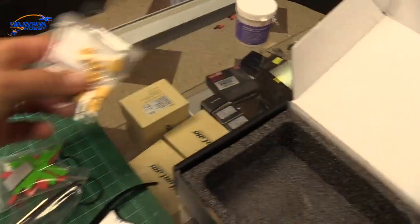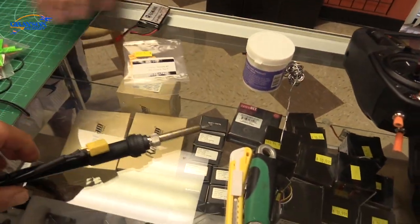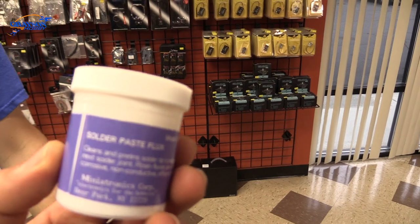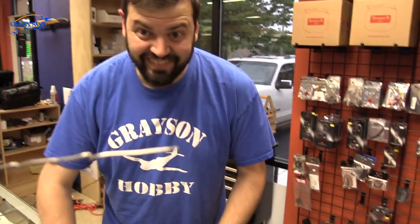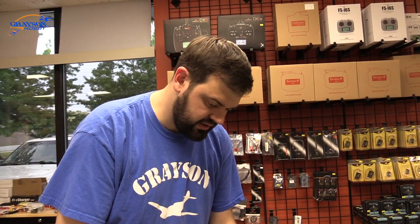Let's show everybody how easy — or difficult depending on your skill — the XT30 soldering is. We've got some XT30s. A soldering iron, believe it or not, is literally an iron powered by an XT60. We have flux — probably the most important thing most people overlook when they're soldering. And full lead solder — 60/40 or 63/37, either one is fine. Make sure you get the 60/40 lead-based solder.